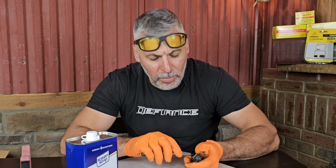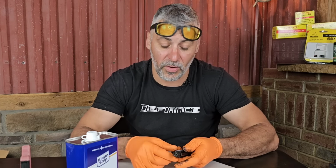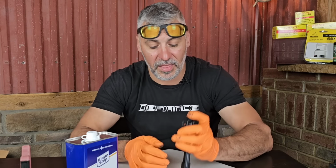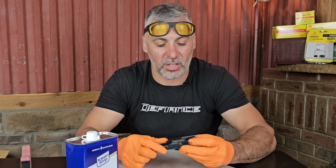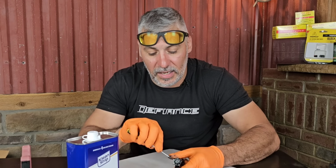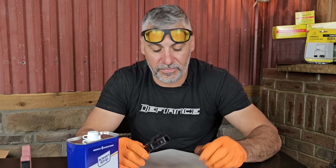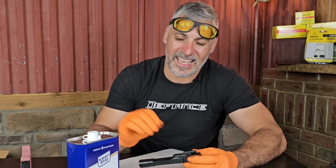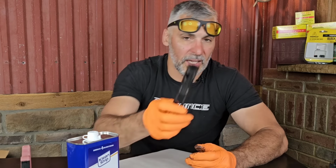So a couple safety precautions using paint thinner or mineral spirits. First of all, I'm going to use mineral spirits. It's a little bit more refined than paint thinner. A little less noxious, a little less toxic. It's petroleum distillates, and it costs a little bit more. You could use either. I like the results from this. It evaporates a little slower than paint thinner. God dang, that's filthy.